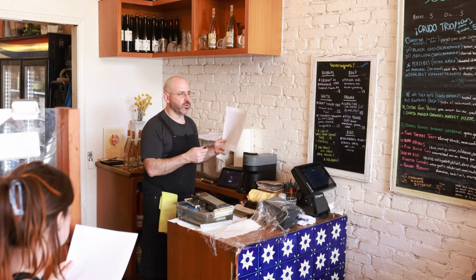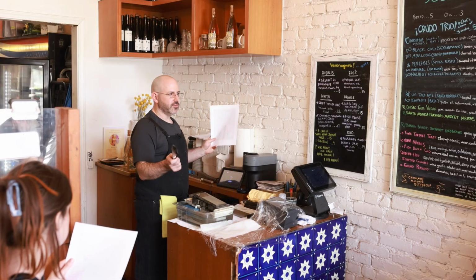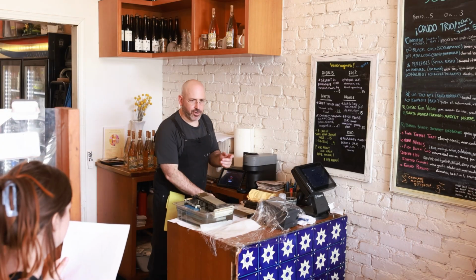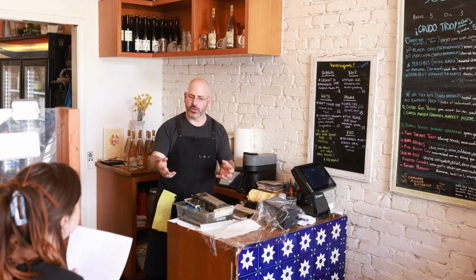Are you guys familiar with what a burr is? Does anyone know what a burr is? No? Yeah? Yes. All right. So metal likes to stay connected to itself. So when we're sharpening on one side, a lot of metal gets ground away. But on the opposite side that you're sharpening, a little bit of metal will flip up and over. And this little flippy piece of metal over here is called a burr.